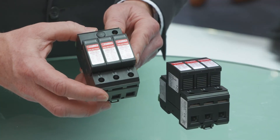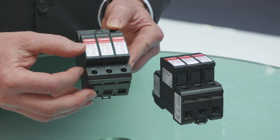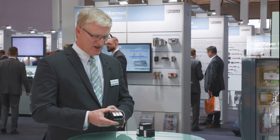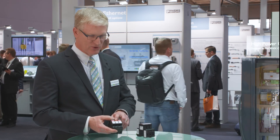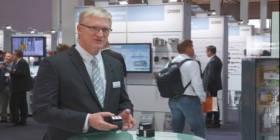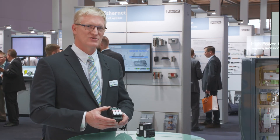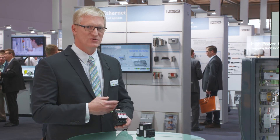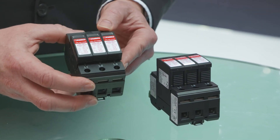The devices are all tested to be safe for short circuit currents up to 200kA, so they're very universally used. They've got all the different voltage variations for the U.S. market, including 480 delta, high leg delta — things you don't see outside of the U.S. So we've now got products that our foreign customers can use to import into the U.S. without concerns about having the right product on the rail. Thank you.